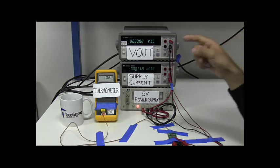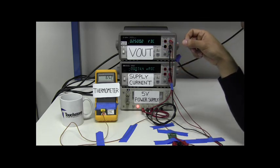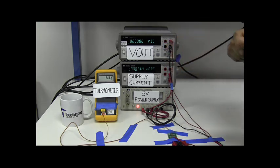As you can see, the output voltage rises to about 2.5003 volts at 85 degrees Celsius. Hence, with a change in output voltage of 1.1 millivolts from minus 40 degrees Celsius to 85 degrees Celsius, the temperature coefficient is approximately 3.5 ppm per degree Celsius.